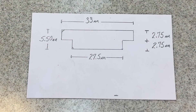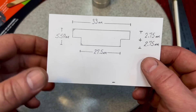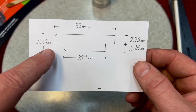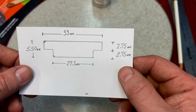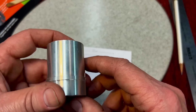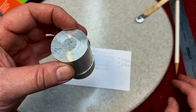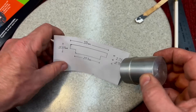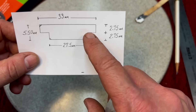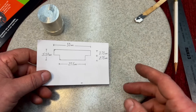Next up, my good friend and mentor from the tool club, Dan Semmel, needed a piece of aluminum in specific dimensions for one of his projects. You can see it's 33 millimeters across the top, 27.5 across the bottom with a little step. The thickness is 2.75 millimeters per step, and 5.50 millimeters for the entire dimension, with chamfers on both corners. I have this piece of aluminum — it's drilled out in the middle, and the challenge with this is holding the piece in the chuck, because these are very small dimensions: that step is only 2.75 millimeters, so the chuck wouldn't be able to grip it.